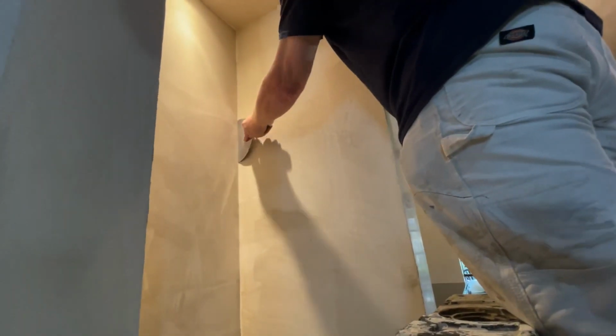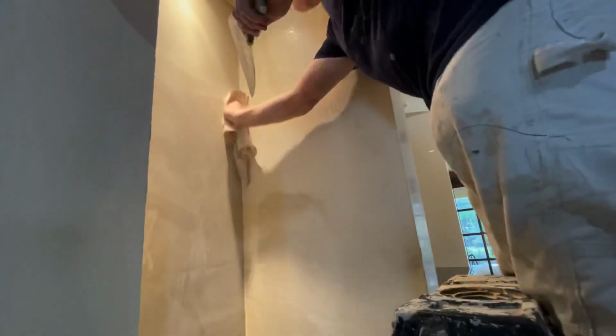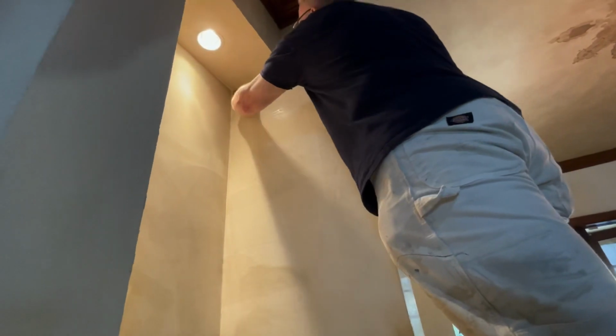Now, as I go into the inside corners, I'm doing a little work. I want to get the crumbs out. Corners are crummy, literally. And you don't want to have scratches in your corners. So, bring your spatula real close to the wall so that you're not gouging it, and go to work. Go to work. You see that? At the same time, you'll be cleaning up the corner, which is to say that you will remove any little crumbs that are there. And then down. Quick! Down! Make that friction shine your Venetian plaster. See that? I'm getting a lot of shine out of dragging it down.